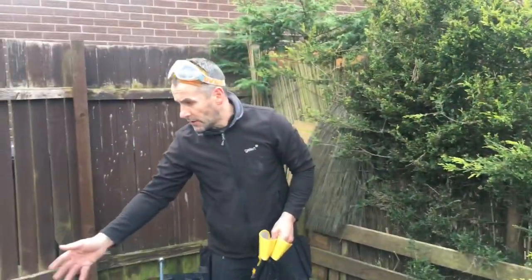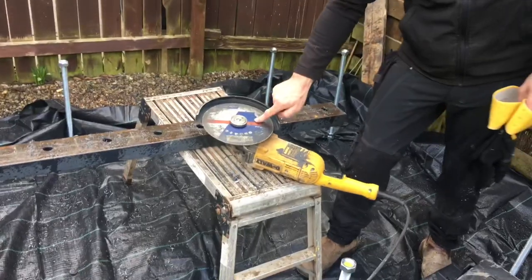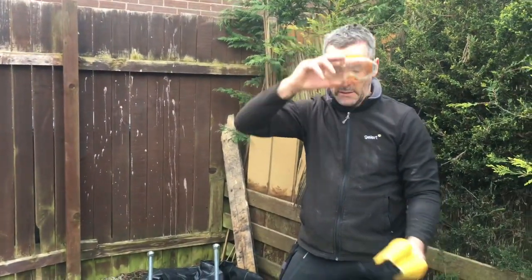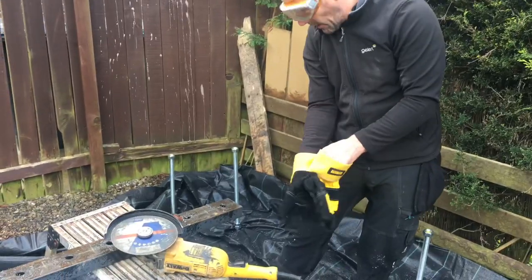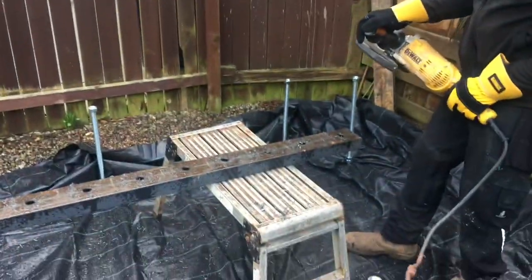John's now drilled the steel. We're now going to cut the steel with this 9-inch grinder with a metal cutting blade. You need to be putting goggles on for this, and these leather gloves will stop it burning through as well. What we're going to do is cut all these up into 6-inch strips and then sit them on the rods.